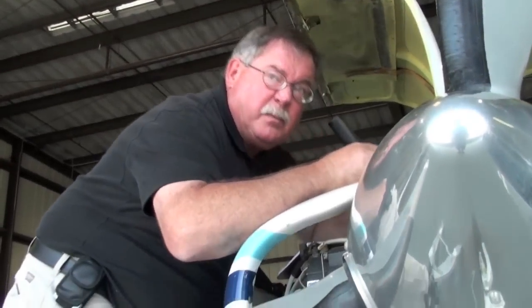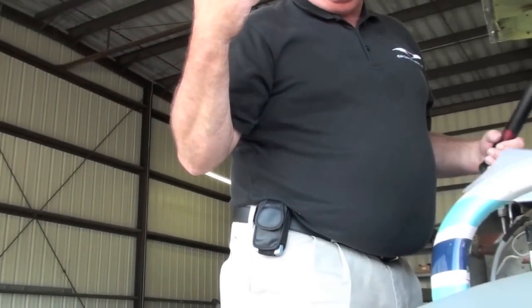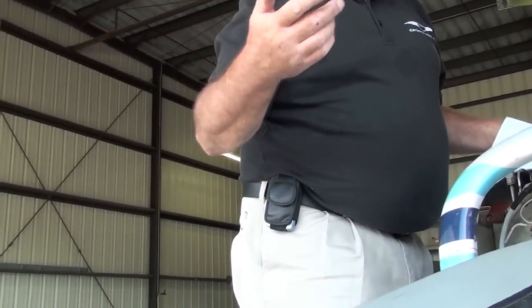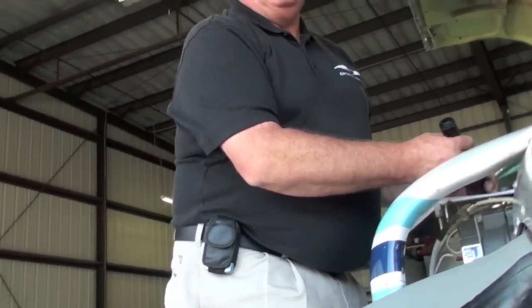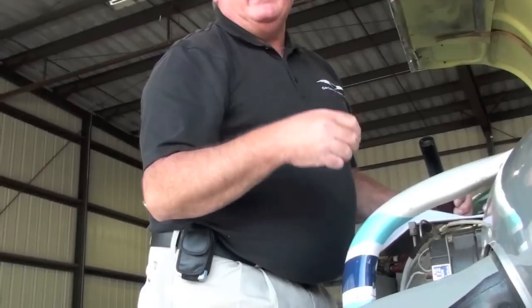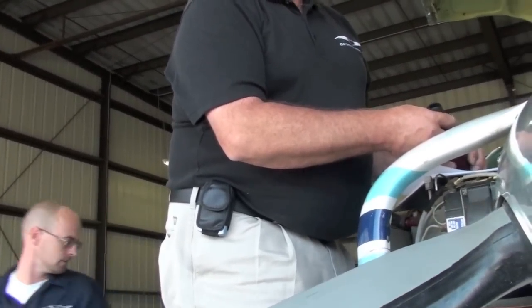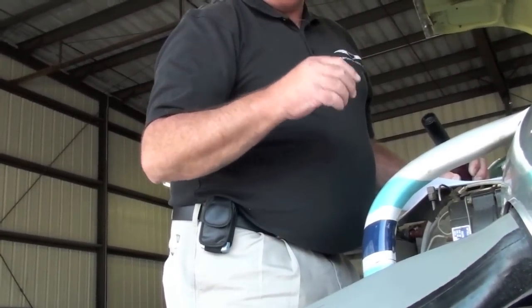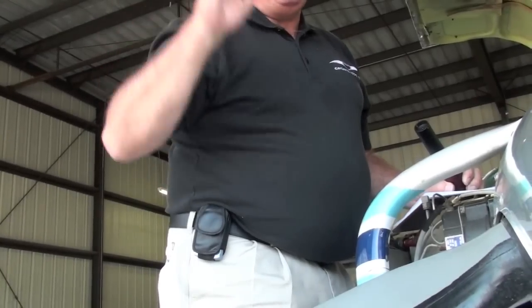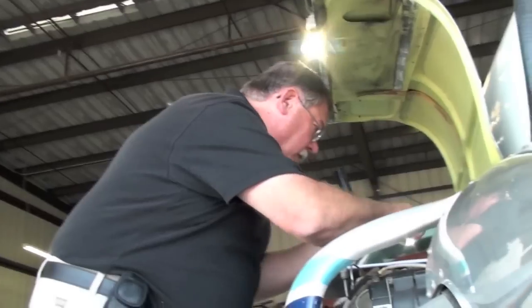Right. You need to get that fuel system adjusted, because if it's too lean and you operate lean of peak, then you can get overly lean, and that can cause you some problems. We haven't been running lean of peak yet, but just best power. I keep reading that it's actually better for the engine. The lower power settings are okay, but you have to watch out for the high power. We run full rich anytime we're climbing. Yep.